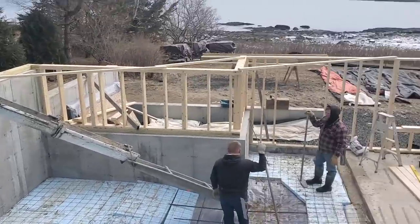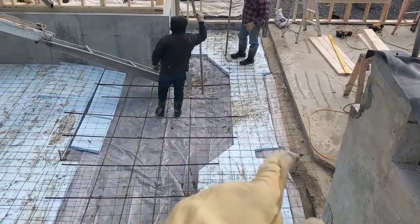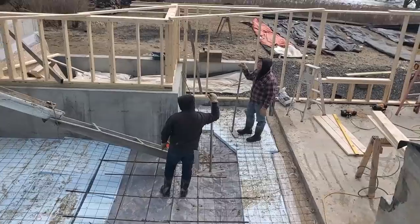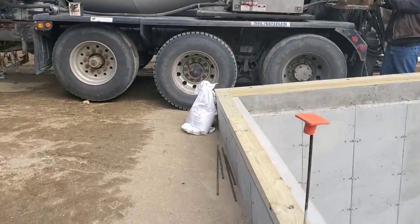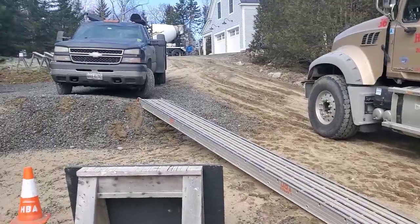We're just getting going. It's about 20 degrees out this morning, going to get up to about a high of 34. They're putting some type of wood flooring over this, so we just need to hand trowel it — get it smooth with a hand trowel. No power troweling today. Truck just got here, we're mixing up. Got a little accelerator we're putting in it, using a 4,000 PSI mix. Second truck just showed up and he's up there mixing.